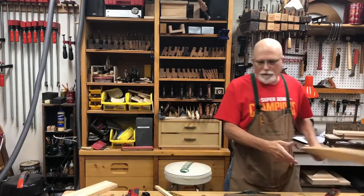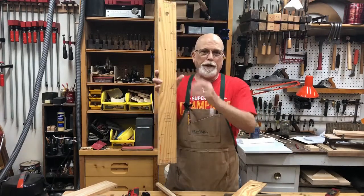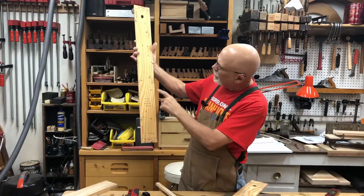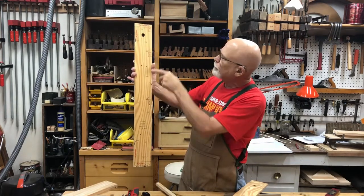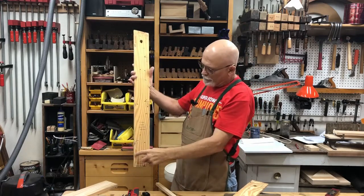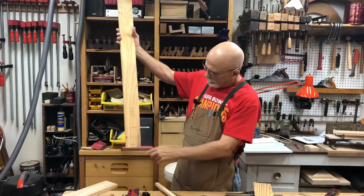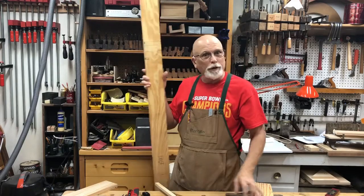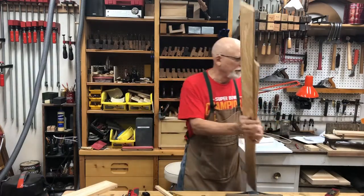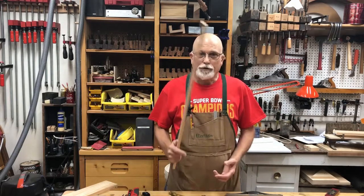Here's an example — this one is a little more involved. This is from the kitchen cabinets; I made a whole set. Here's the bottom, the front, where one cross piece would go, and the second one and the top one — so there was a one big drawer, two drawer, three drawer configuration. It showed where my other braces were going to go, so I used that for all the cabinets, then did the same thing with the upper cabinets. I only marked it once on this stick, then used it against the other boards to mark off of here. If you've got any sort of cabinet or something with multiple times you're going to mark the same thing, the story stick is the best way to go.